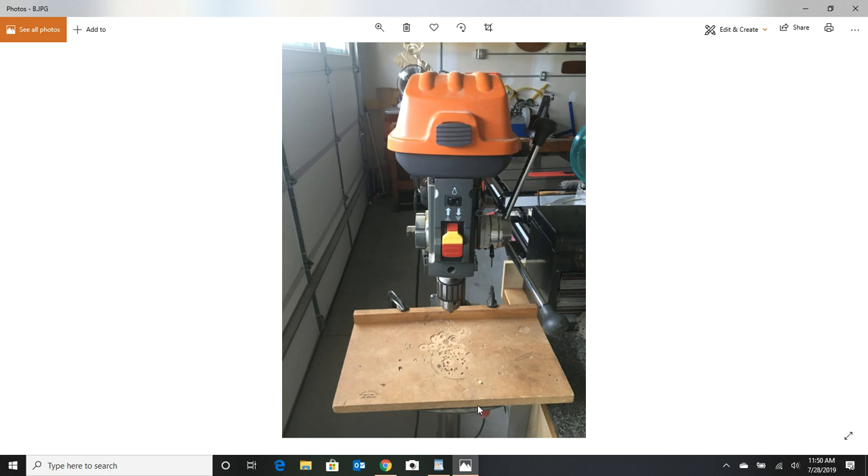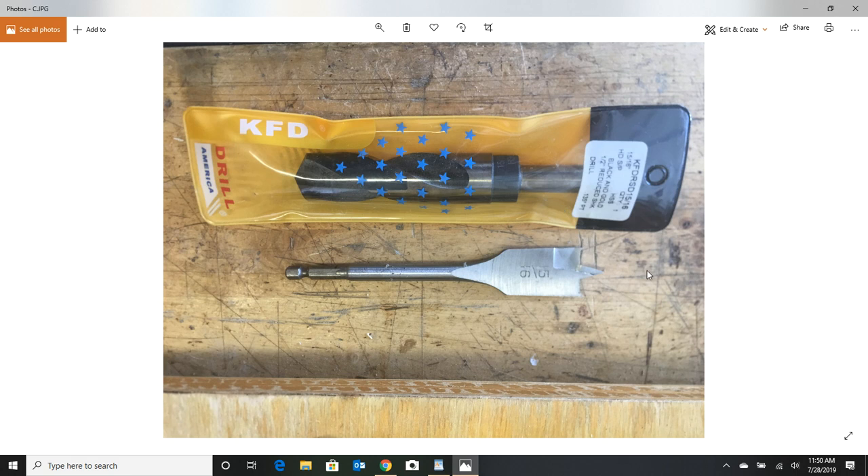The key is that it is a drill press with a table that you can angle, because you'll need that when you drill holes for railings on the stairs that are angled. The next thing you'll need is some bits. This 15/16 spade bit on the bottom is going to do the lion's share of the work — you'll use that to make your jig and all of the holes in all of the 4x4s. The only thing you'll use the top bit for is to finish the angled holes for the railings on your stairs.